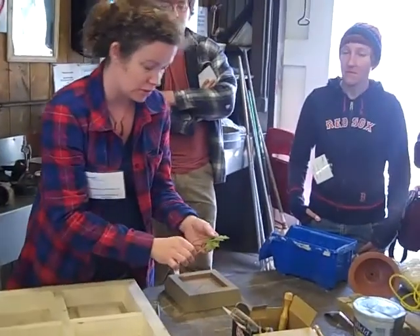You can inclusion cast stuff — get things stuck in the metal. So inclusion casting is like putting the copper in there? Yeah, or other objects. Some things we might not want to do, but just run your ideas by us. Like if you were to inclusion cast a leaf, would that just burn out? Well, it'll actually leave a residue of the leaf, so it'll probably take up some of the detail. But it will break off — you'd get charred leaf that would pull off, and you might just get a blank. It's just the carbon residue of the leaf burning out. You'd get more of the leaf pattern by pulling it out.